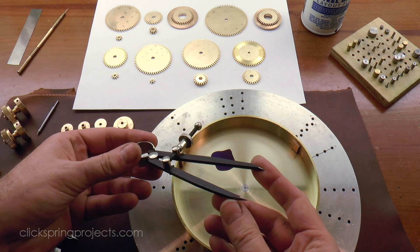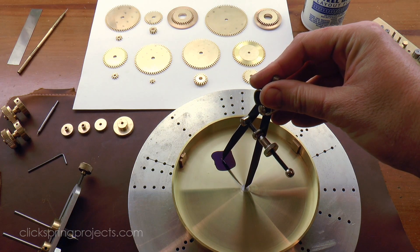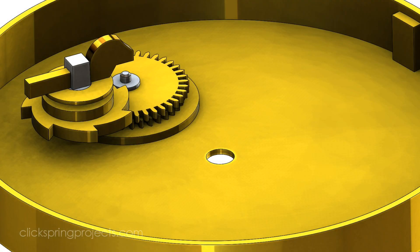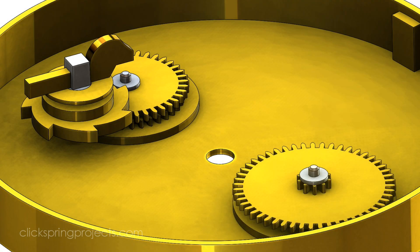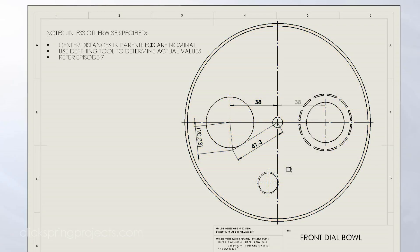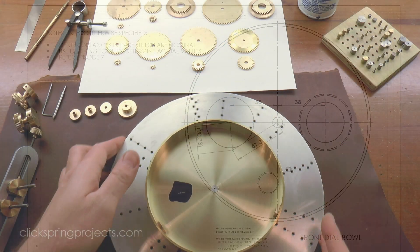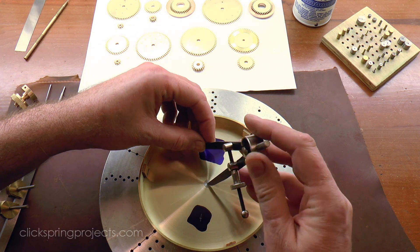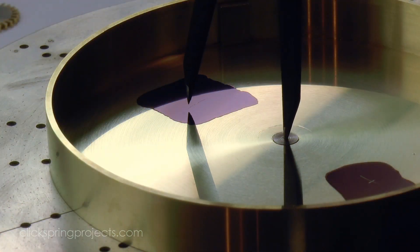The second arc identifies a specific radius from the center of the mechanism, and with that intersection the assembly's position is determined. The solar zodiac and node display assemblies are required by design to be diagonally opposite this first position, and at the same radius from the center. And so the position can be easily constructed using a straight line and another arc struck from the center of the bowl.